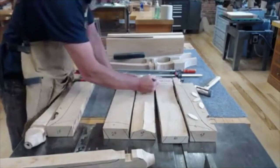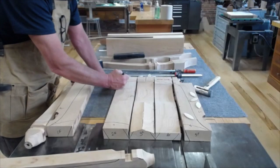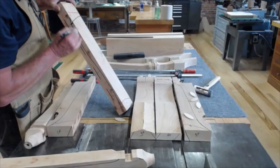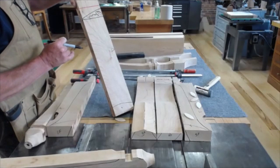We obviously don't want to start our cut back here. People make this mistake all the time. You've got a funky looking seat. And you can see where the bowl starts. So we want to mark this so that we start our cut here. Follow that? And we'll have to use a grinder to sculpt this section out afterwards. But if you start the cut here, there's no recovery.